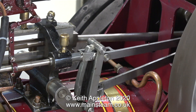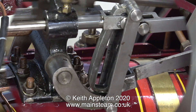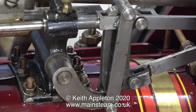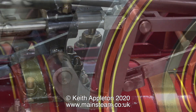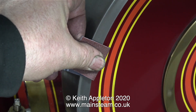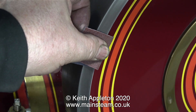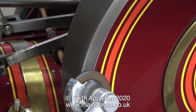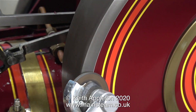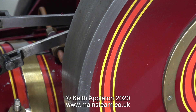For now I'm just going to leave the engine running with various shots from different angles. I can't run it for long because my very small fridge-type compressor is really working overtime, and when it starts to overheat I do feel obliged to turn it off. I thought I'd take this opportunity while the flywheel is spinning to hold a piece of emery cloth against the outer edge — I've done this many times on steam engines, using the engine's own power to clean up the flywheel rim. Using the flapper wheel spinning lightly against the flywheel edge gives a really even finish, although there's still quite a way to go before the rim becomes very smooth and highly polished.